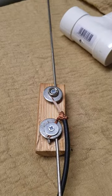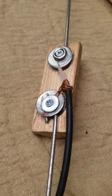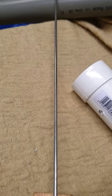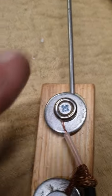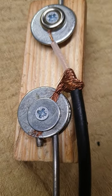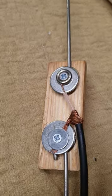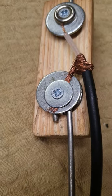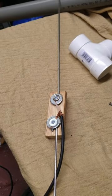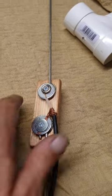Before I put it together I better show you the wiring. Your coax — the central core must go to the top: that's your transmit. Mark the top — I normally just write 'top' on it — so when you put it together you make sure the central core is on the top element. The outer cabling you attach to the bottom one, and that's your receive. Nice and simple wiring. You'd stick a cable tie around it just to hold it all still.